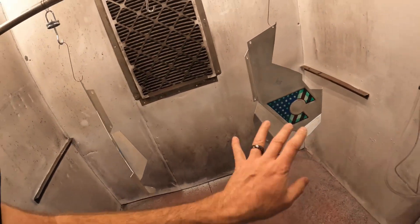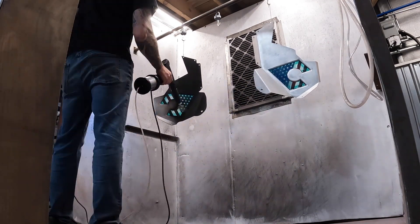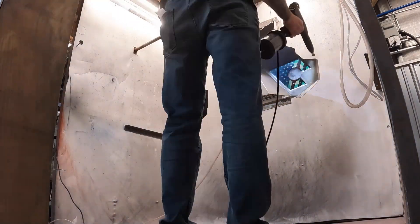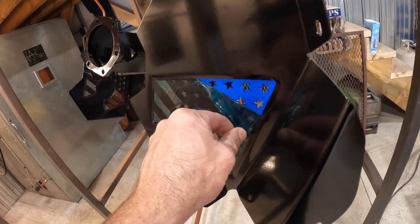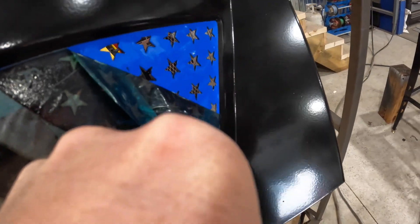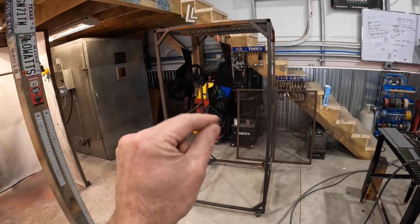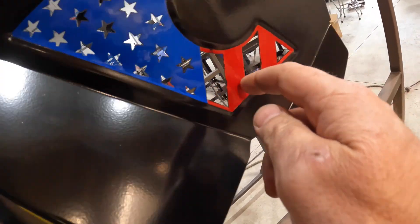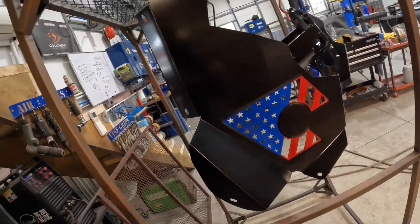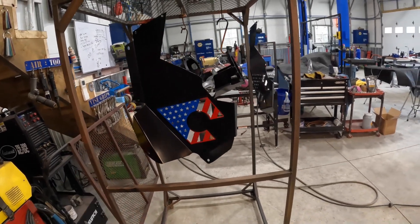Last piece of the puzzle — the fronts are all taped, not the backs. We're going to lay on that black, clean off the excess, and this should be it. The black, the last step, has just flowed out. These are very hot so I'm going to go ahead and start peeling the tape off — the hard edge seams can start to flow out. Tape is peeled — we've got a little bit we can trim with a razor blade, not a big deal. All in all they look pretty good. We'll put these in the oven, let things flow out, finish curing, and then I'll show you the final product.